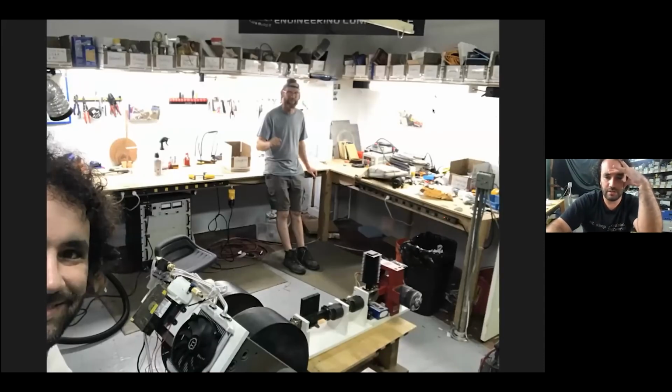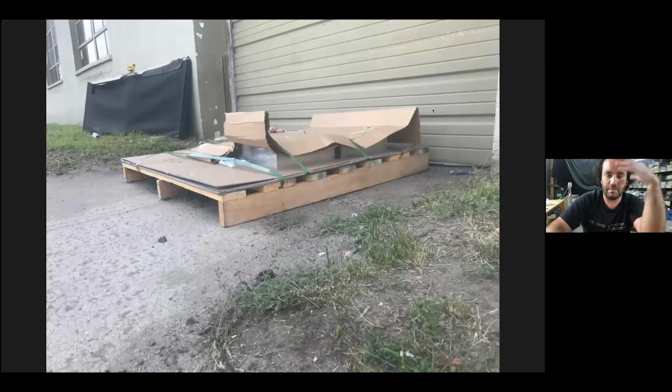And here's Aiden smiling. Oh, and then we got some aluminum blocks over here. That's for a later experiment that I'll get into a little later. Basically, we're trying to make a waveguide in the shape of the hull of the craft and have the magnetic field lines create sort of a homogeneous field based on whatever magnet we have in the center, and that would sort of create a flying saucer shaped craft. To do that, we're going to use two big blocks of aluminum as dies and basically pound another piece of thin aluminum plate in between those aluminum blocks. That's what you're looking at over here.